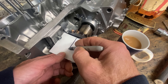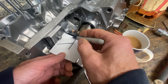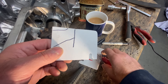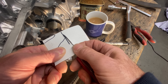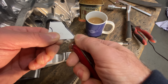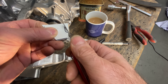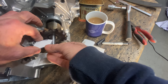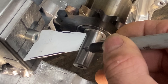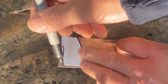I had a rummage and found a piece of bar that fitted nicely into the bearing, so now I'm making a cardboard template to finish the bracket. My pen-knife scissors are never too far away — I use them a lot for cutting out cardboard templates. After a bit of fine trimming the cardboard template fits just right, so now I can cut the piece of bar down to length, then transfer the template onto a piece of steel and cut it out.